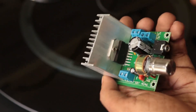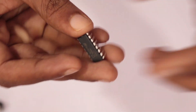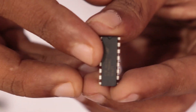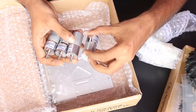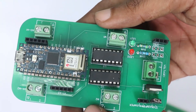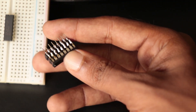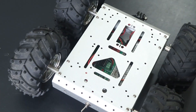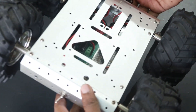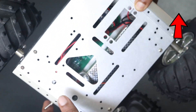You can easily drive the DC motors using a simple H-bridge circuit or a motor driver. In this project, I will be using L293D. These DC motors draw a huge amount of current and we have 4 of them. So I will be using 2 L293D in a piggyback configuration, which simply means connecting them in parallel. This will double the current and enables you to control two sets of DC motors at the same time. If you are not sure about piggybacking L293D and doubling the output current, make sure you check this video.